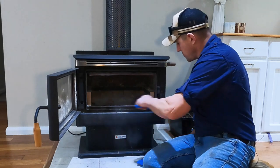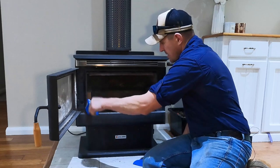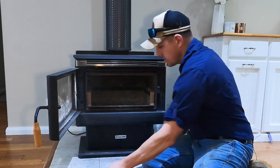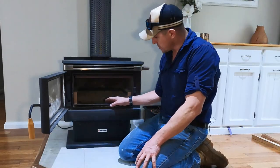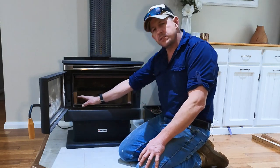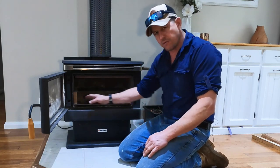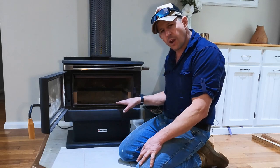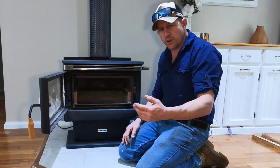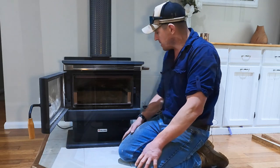Then we just give it a general sweep down at the front — nothing special. Just make sure we get rid of all this stuff and that the seal has something good to sit on. I also check to make sure that all the fire bricks are fairly well intact. It's okay for some of these to crack — it's not ideal, but if the bricks are cracked and still located together, they'll be fine. If your bricks start to degrade, crumble, and fall away and they're not protecting the steel at the lower part of the firebox, get down to your local supplier — places like Calora, Bunnings, and other hardware shops have all that stuff.